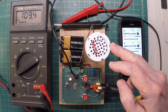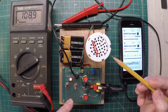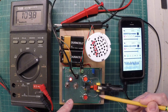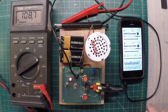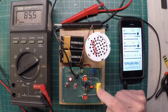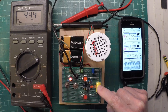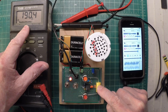And now you can hear just a little change there in the audio. It's a little difficult to hear, especially if you've got a noisy background, that this direction here toward me is the outer foil — so this location here. So again, in my design here, the loudest sound or the highest amplitude on the meter would indicate the outside foil, which will be this lead here.